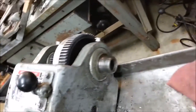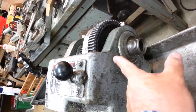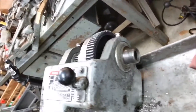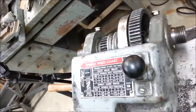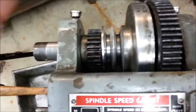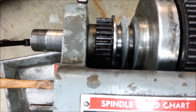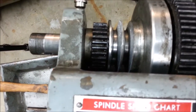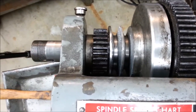I noticed on this lathe we have the indexing holes, but no place for the pin to go in and latch into them. I don't really understand why that would be omitted from one of these lathes. Something else I noticed that's a problem: these pulleys are very worn. I'm going to have to figure out how to address that — I could cut them again and make the diameter a little smaller, or I could machine that off and shrink on a fresh pulley, which would be the best way to do it.